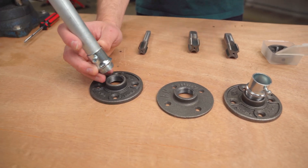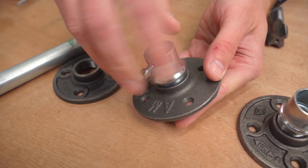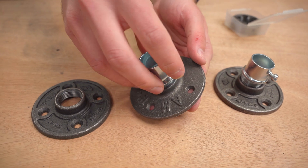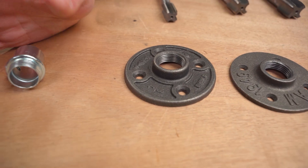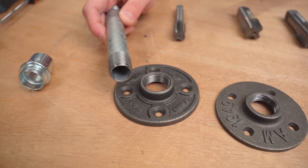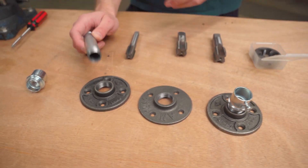We explored how you could use a flange from Amazon that allows you to just thread directly into it. The reason that works is because the threads are just a standard straight thread — not anything fancy or specific to code like you'll find with off-the-shelf flanges. The key difference is NPT threads. The threads you'll find for rigid conduit and plumbing flanges use tubing that tapers off, so those thread into the flanges with tapered threads — that's for sealing gas and similar applications. For a DIY project that's not as important, but we still want to make the hack work.